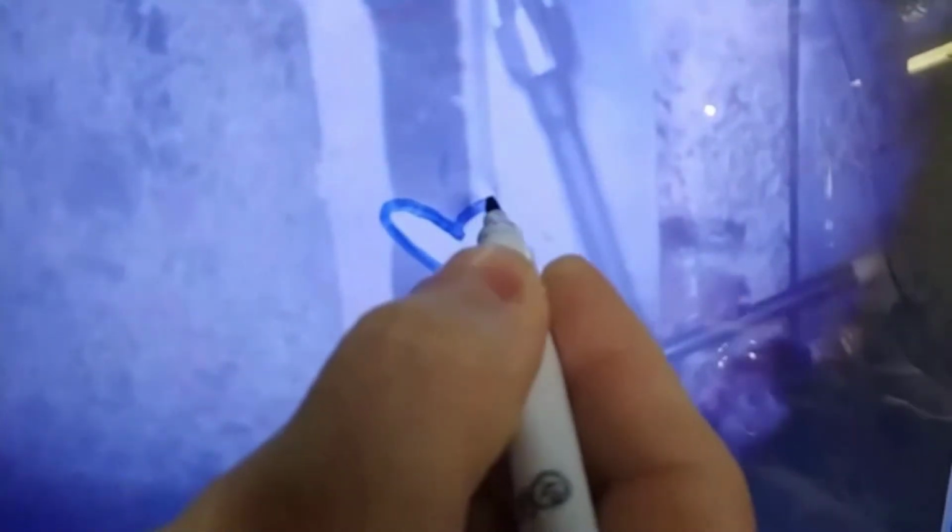So that's a dilemma. And Trent Bosch was the one who came up with this idea of how to use a camera. You draw on the screen on the laptop with a dry erase marker, you draw the contour of the cutter onto your laptop screen. Then when you stick the camera into the piece, you know where the cutter is. I think it's so nifty.